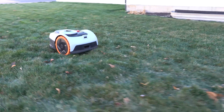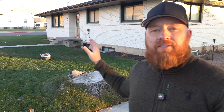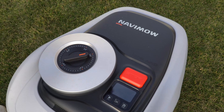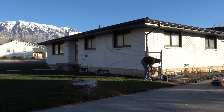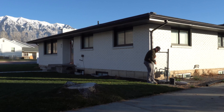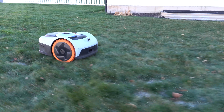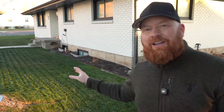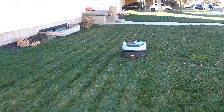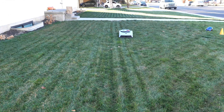It is capable of taking up to a half an inch of grass off the top. The i2 series all-wheel drive I have has height of cut options ranging from two inches up to three and a half inches. I've got it on this lawn — I call it the maintenance lawn — which has Kentucky bluegrass. Right now it's set at about 2.4 inches height of cut, and the mow quality has been really good. One of my all-time favorite things is just the striping capabilities — it gives you that nice, fresh cut.